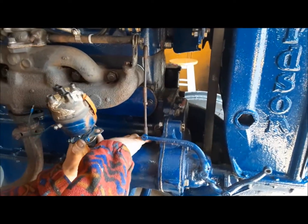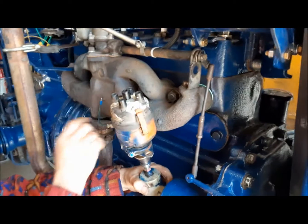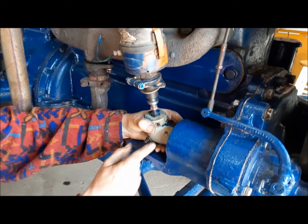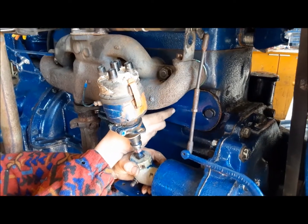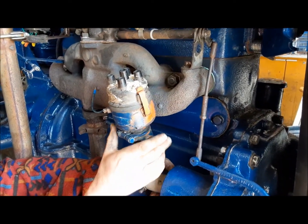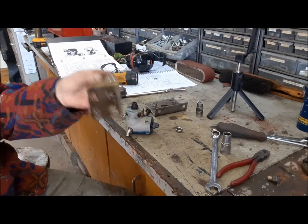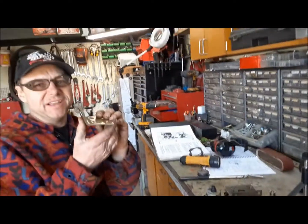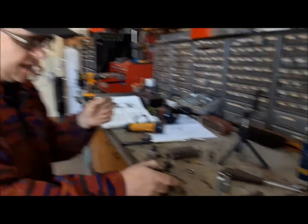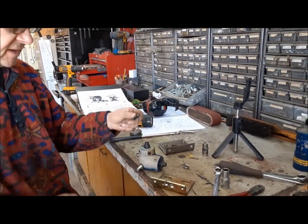Let's get her in here. That's about where it'll sit — not too bad at all. We're going to make one bracket to hold our gearbox here, and then another bracket welded to the lifter cover to hold the distributor solid by the clamp. We've got our bracket fashioned — I'm okay measuring on right angles, but once I start having to measure angled stuff I get lost easy. The drill gearbox had a carriage bolt through it as a means of attaching a D-handle, so that's how we're going to attach it to the tractor.